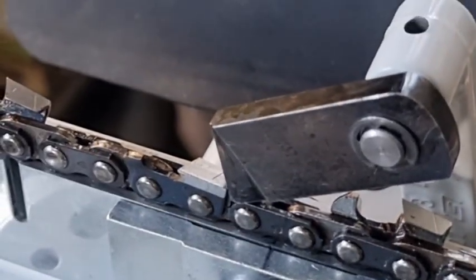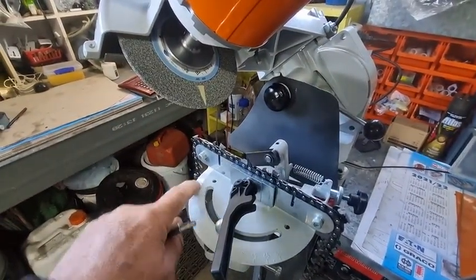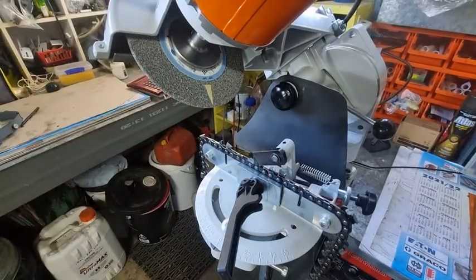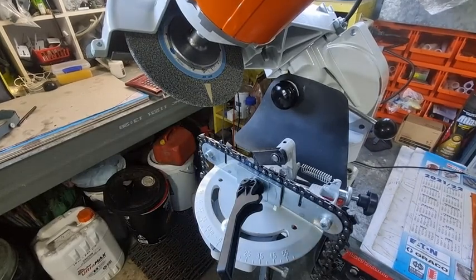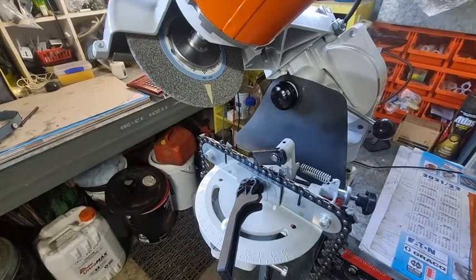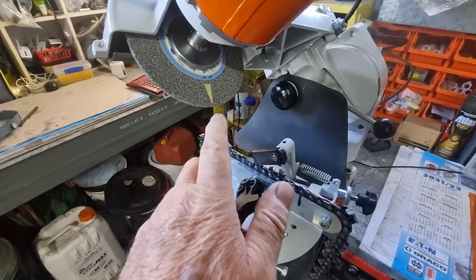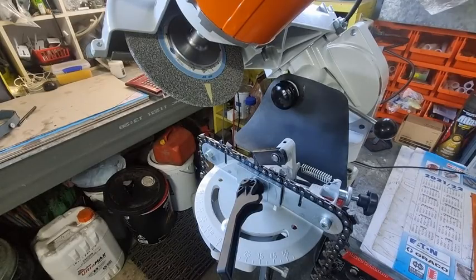The relevance of 17 millimeters offset is that when you turn the vice left or right it moves right across the face of the grinding wheel — the white mark is the center line. What Stihl does is move the B scale sliding vice minus 15 millimeters to positive 15 millimeters to compensate, so that the tooth is very close to the center line — just slightly off to the left or right when doing a left-hand or right-hand tooth. That is how Stihl set it up for all their chains, semi chisel and full chisel, except for Hexa, Rapid Duro, and rescue chains which are tungsten carbide.